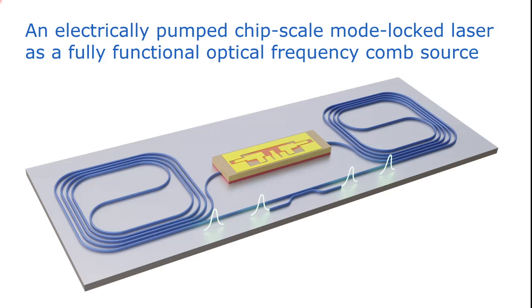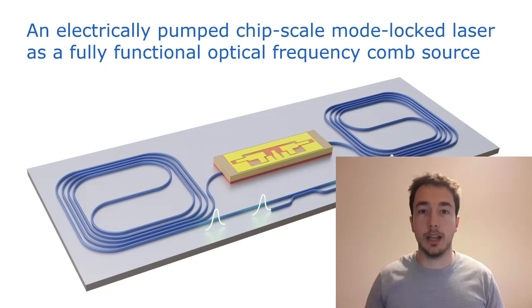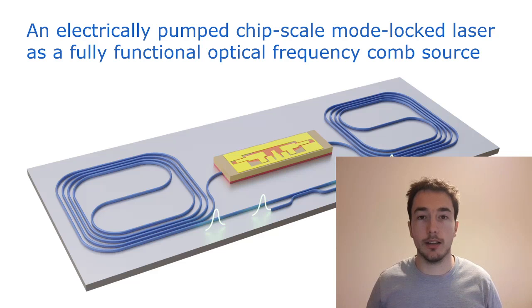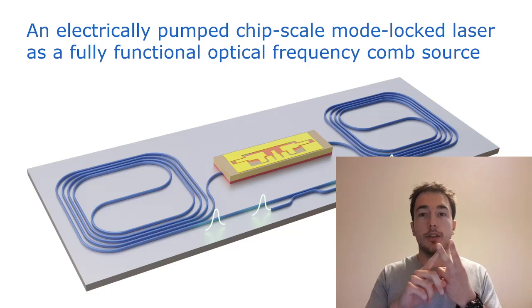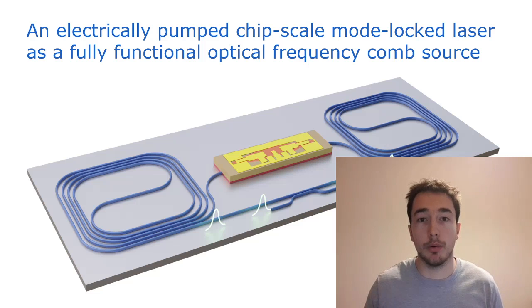To resolve these problems, we have been working on an electrically pumped chip-scale mode-locked laser as a complementary technology. It consists of an electrically pumped amplifier combined with silicon nitride as a waveguide cavity. Silicon nitride can have very low losses, which means we can make large cavities to achieve a low repetition rate, and also the photon lifetime can be large, giving excellent noise performance. The second advantage is that silicon nitride does not suffer from two-photon absorption, unlike silicon, meaning we can in principle offer high power operation, which is needed in optical ranging applications.